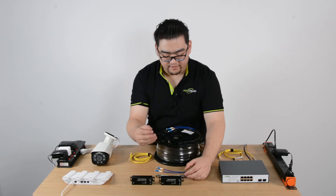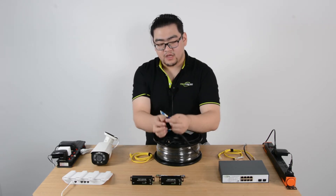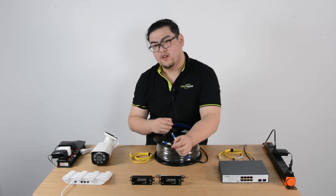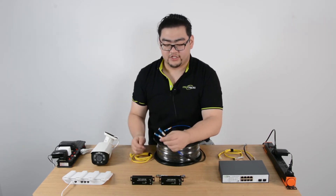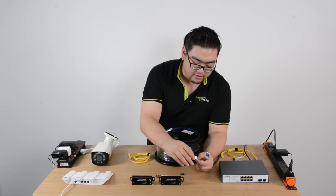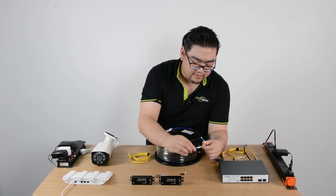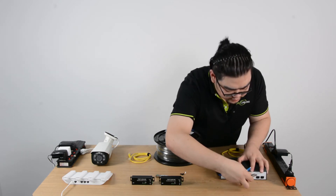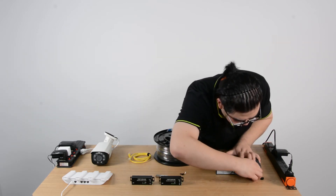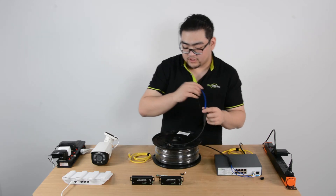So I'm going to show you guys how to connect them. These are very easy steps. First, if you have a duplex cable like me, you'll have two lines. It's really important we remember to choose the same end. If we have A on this end, we're going to have to connect to A on the other end, or it's just going to create a connection that doesn't go through. So first, we're going to use one end — we plug our fiber optic cable A into the SFP pluggable. We just open the lid on our POE switch and then plug it in. It's not that hard. And then it's working and reading its signals and starting to transmit signals once the other end is ready.